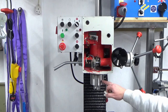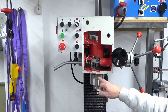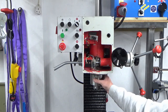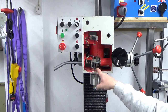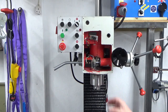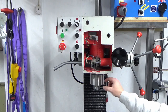I've got this bracket thing to fit. The only purpose it serves, this bracket that sits around here, the red one, is for the rod that goes up in here for the depth indicator, and I will refit it for now. But I think what I'm going to do longer term is buy myself some aluminium plate and make myself a different quill plate there that's going to allow me to put a digital readout on this quill, and also multiple other uses. So I'm going to give it some thought, but I'm going to design a new quill plate to sit on here and make it out of aluminium, probably 10-15mm thick aluminium plate, something like that.